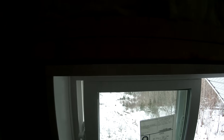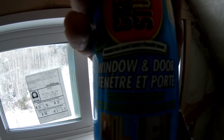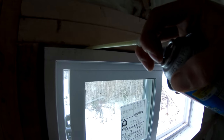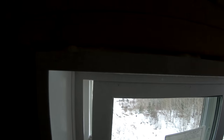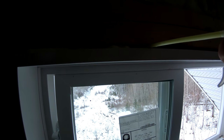Working on the cracks around the windows — this is 'Great Stuff' window and door insulating spray foam. Make sure you get the low-pressure stuff — the other stuff isn't good for window cracks. I just put her in there, fill it right up. It's gonna ooze out of the crack — not worrying about that at all. Once it dries you can cut it back, no problem. If you get some on the floor it just snaps right off. Messy to deal with but easy to clean up.